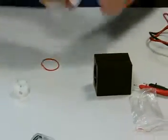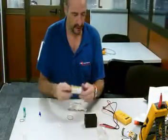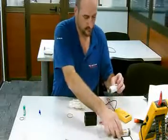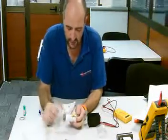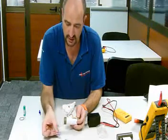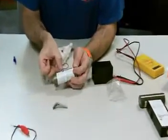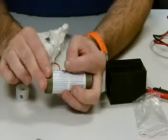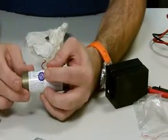Again, wash the beacon on the outside to clean any corrosion, and now we have two possibilities. On the Edition 2 beacon, we have a second place to place the new sticker. This sticker must be placed on the point where the circle is and orientated to the month that you replaced the battery.